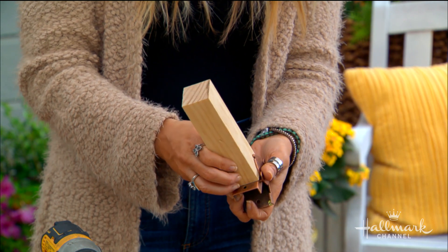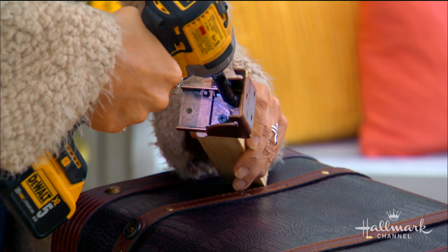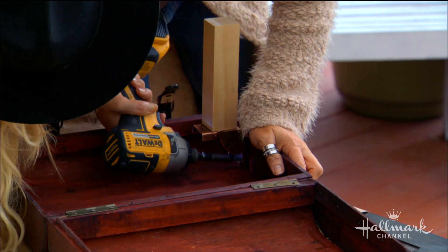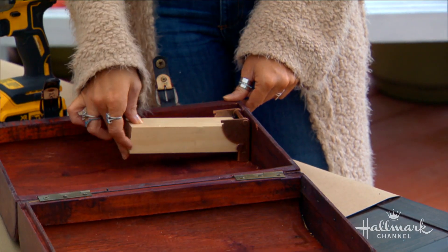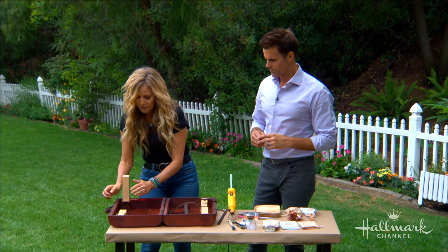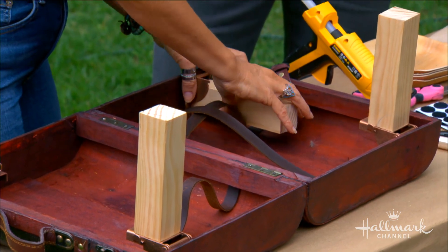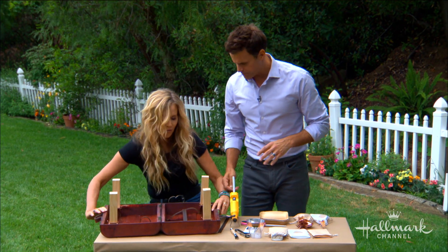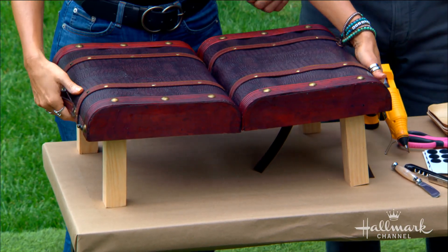This is an extendable leg gear for wood. You can put it on a table, you can put it on anything, but right now I'm putting it on a suitcase. So you add a two-by-two wood, which is actually one-and-a-half by one-and-a-half — that's very important. I glued it just to hold it in place. There are three little holes back there, and that's why you need the wood, because you actually need it to attach to something. You can see the little mechanism — it goes up and down. It functions so well and so easily. If this was made out of leather or canvas, it certainly wouldn't work. So all four legs out, let me turn it over — and it becomes our little table. Look how great that is. It functions as a table off the ground, which keeps those critters away.